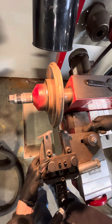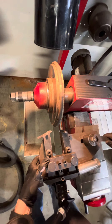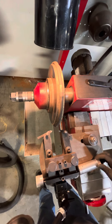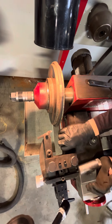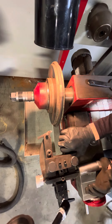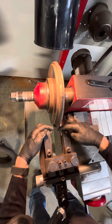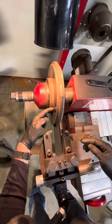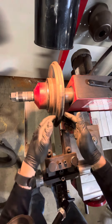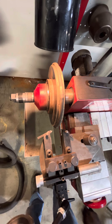I like to square the tool up the best I can, right in that area, and then I'll tighten it up. Now I'm going to run this guy out and push it in. The gap is getting better, and I like to have these teeth pretty close to each other because we've got to cut all the way down to the inner lip on the mating surface — and there's not a huge lip on here either.